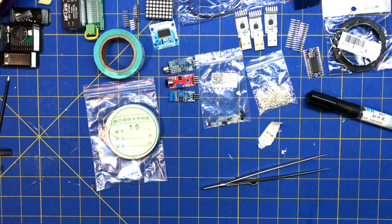All right, so let's look up 951. I never used a liquid no clean flux. I can't see that it would do anything because there's no solids. It felt like there was no solids. I wonder what the carrier solvent is. Kester 951. Zero halogen non-rosin flux designed for wave soldering, conventional and surface mount circuit board assemblies. Extremely low solids content, 2%. Nature of the activator system results in practically no residue.